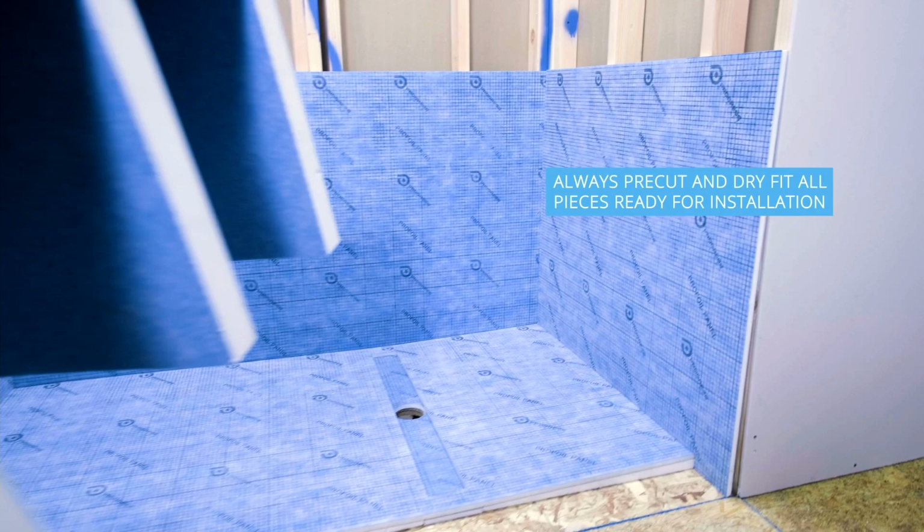Here you're going to see what happens. You put the first wedge in the front, then after the first 36 inches, you basically came up 3/4 of an inch. So there is a filler board. It's a straight piece of foam. You can do it with 3/4 inch plywood, but with the cost of plywood nowadays, it's cheaper to do it with foam, but you can still use plywood if it's readily available.